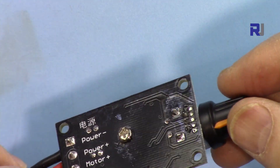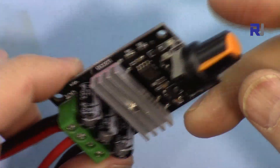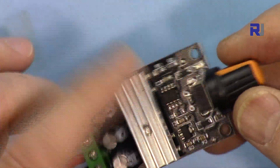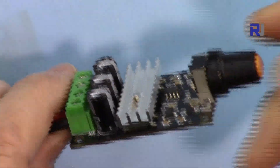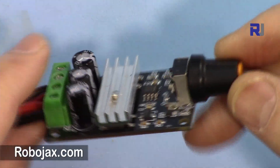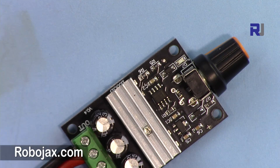The conclusion is that this is the best motor controller you can get at this price — very durable. I've tested it up to 10 amp, so 3 ampere is nothing for this; it can even handle 5 or 8 ampere very easily. I haven't tested it for longer periods so I don't know what it does long-term, but if it can handle 10 amps for a minute, then 5 amp and 3 ampere continuously will be nothing. Please thumb up the video, share it, and subscribe to my channel for upcoming videos. Thank you for watching.